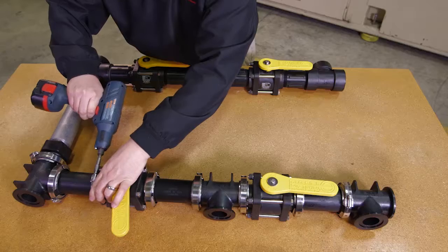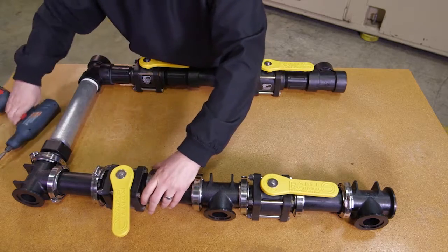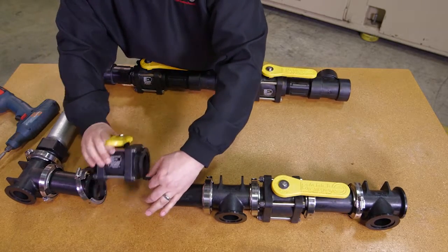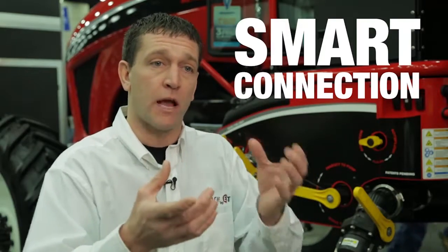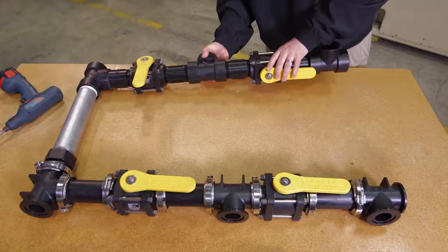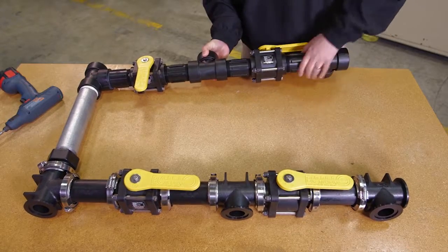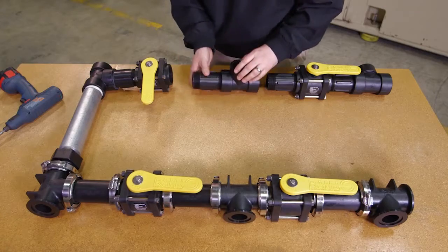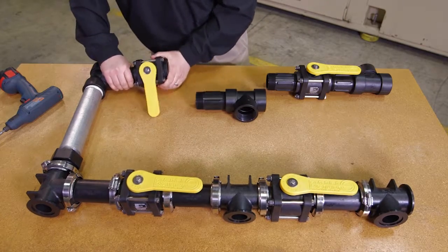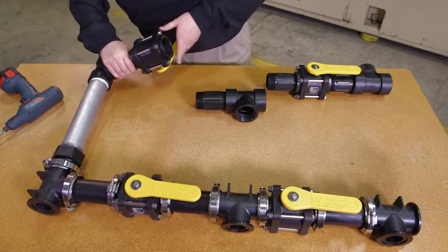When I have a section of fittings together and they're manifold clamps, I pull two clamps off and I can take this one check valve out and inspect it, put it right back in, put two clamps on and I'm done. With a threaded system, I have to start at one end or the other and take parts apart until I get to that piece. As you can imagine, it takes a lot more time to mess with the threaded parts.